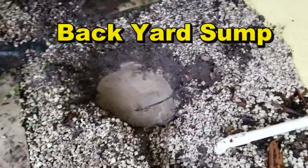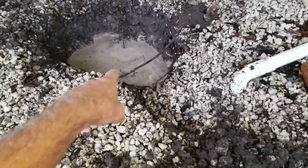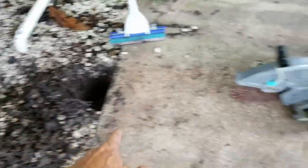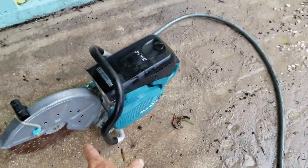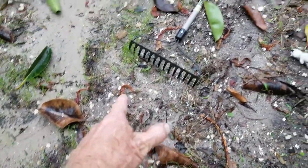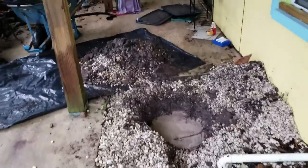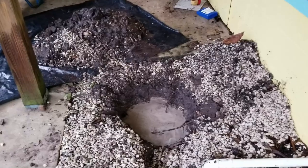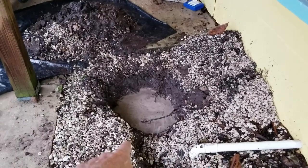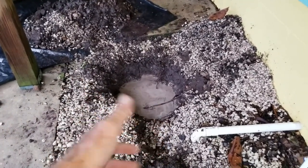What we're going to do — and you can see the water already, this is groundwater — we're going to put a sump pit and a sump pump right here, and the discharge line is going to go across, actually under this concrete. You can see the concrete saw — we're going to cut that. It'll come across and tie into the footer pipe discharge we've already installed, which runs all the way out to the back. It's raining pretty heavily, so we'll put the sump pump down in the pit as we dig and just continue to pump that water out so we can keep digging and get the pit down into the ground.